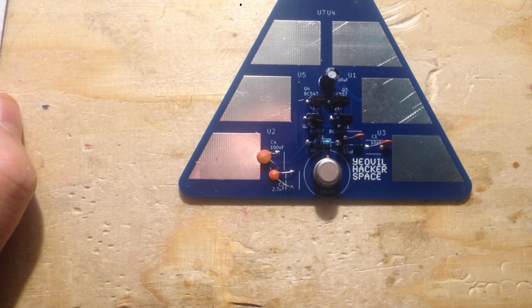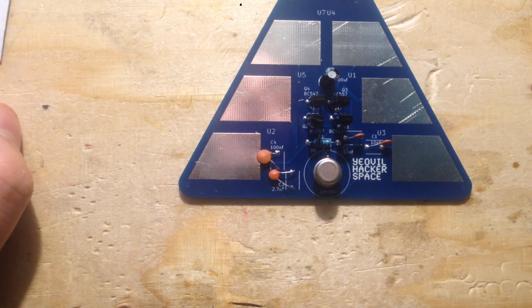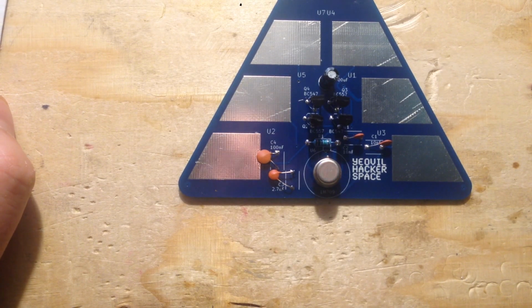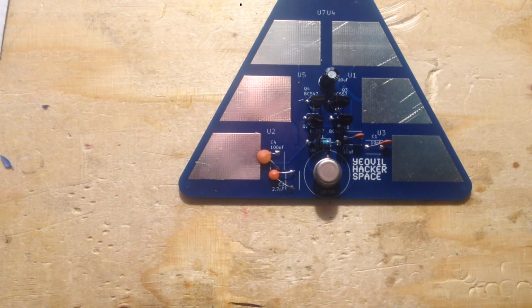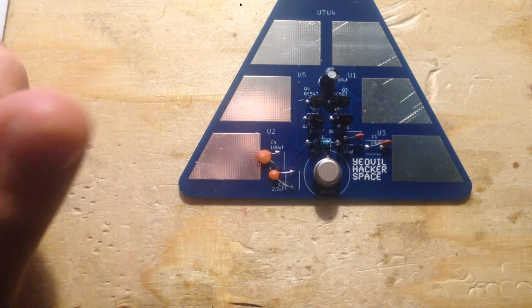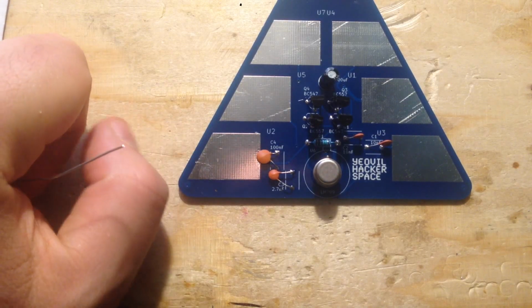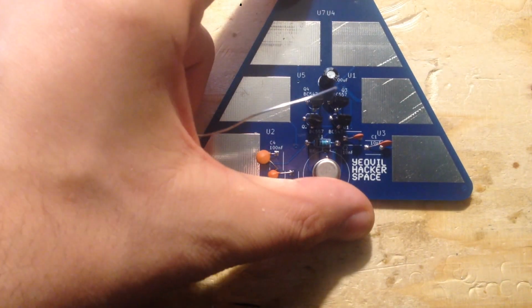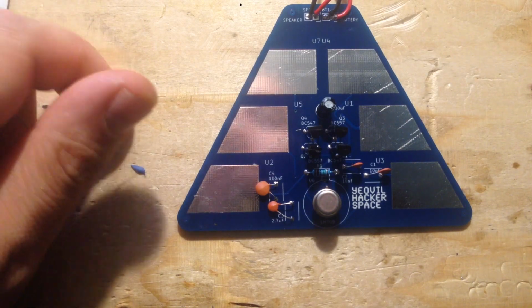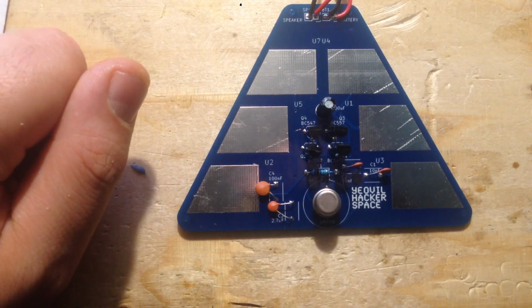With solder, I generally use 0.6 millimeter solder for through hole stuff. The stuff we had was a bit thicker. Inexperienced people in general have a tendency to apply too much solder, and with thicker solder it's very easy to do that. So I would use a medium gauge, like this kind of thickness. I want to say use leaded solder too, though I don't know if that's allowed, but I think leaded solder flows better. I'd bring some flux as well, and more stuff for rework.